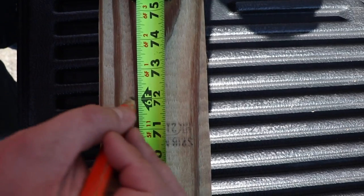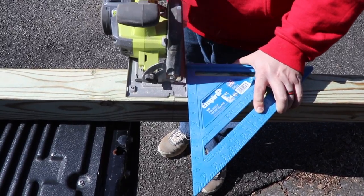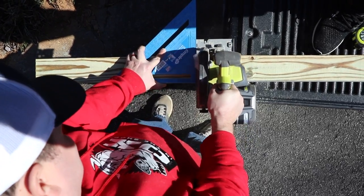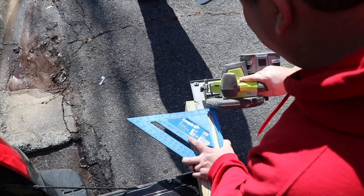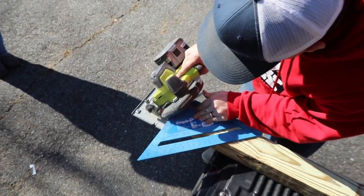I use a four by four — one four by four that I cut to six foot for the post. I actually used an eight footer. It might not be a bad idea to use a ten footer just so you can sink it down a little bit deeper, so it's actually two feet in the ground.